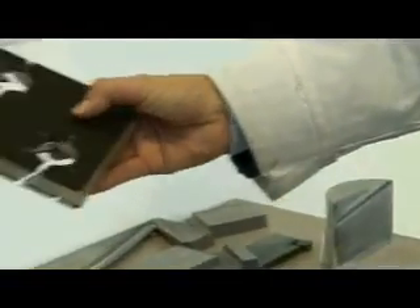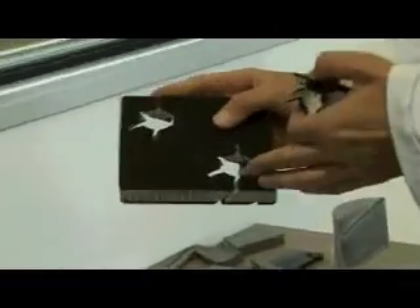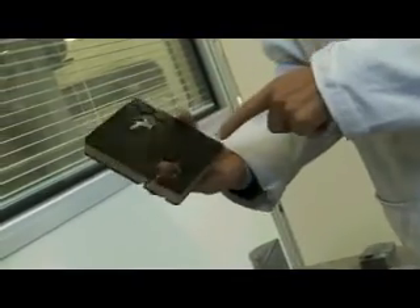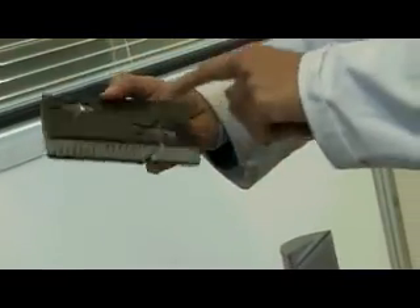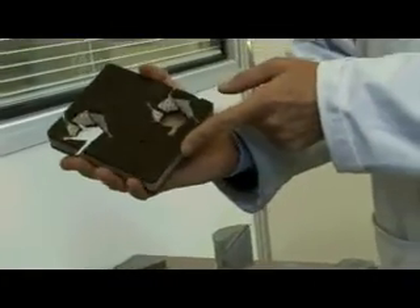This one's pretty cool — this is a window from a composite fuselage, a Hawker Beechcraft aircraft. Composite fuselages are the state of the art; Boeing's making a composite aircraft but the fuselage is always difficult to construct. Anyway, this is cut out using a water jet — they pre-drill the hole and then cut it out. It's a Nomex core and you can see there are some shiny bits in here — that's metal and that's for lightning strike.